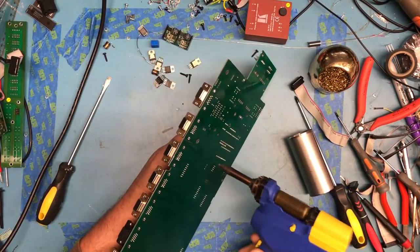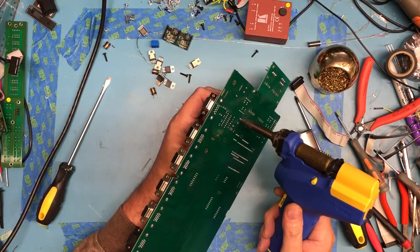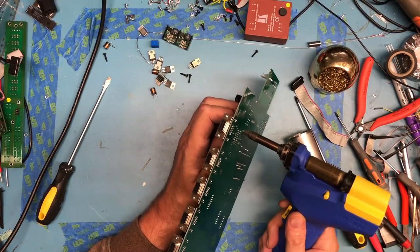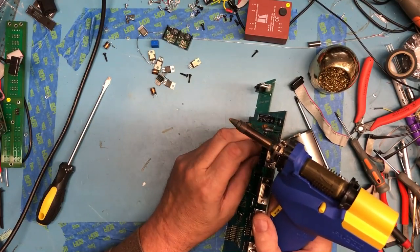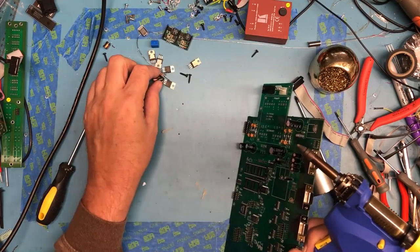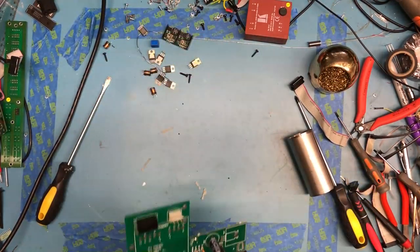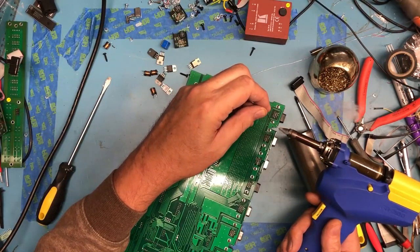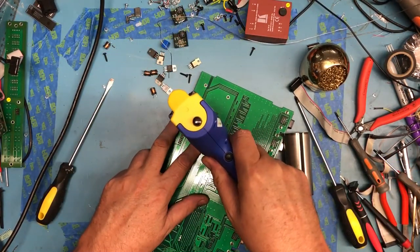We'll grab these couple of inductors. That's not the inductor, this is. There it goes. Electrolytics, of course, there's no reason to grab those. They've lived in this case for some period of time. I just don't reclaim electrolytics. It's just not, to me, a wise use of component reclaim. Let's see if I can get one of these dip sockets to drop off.